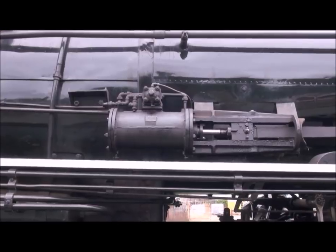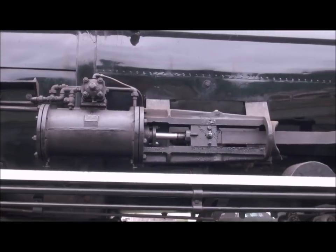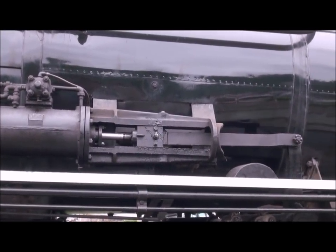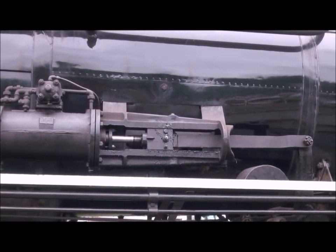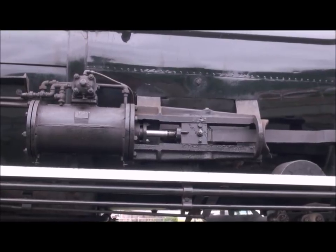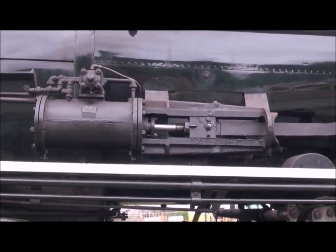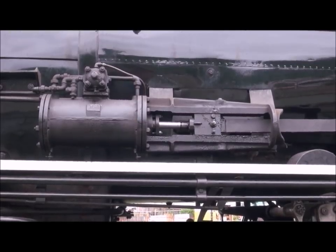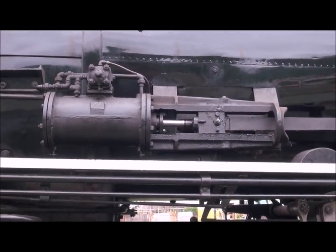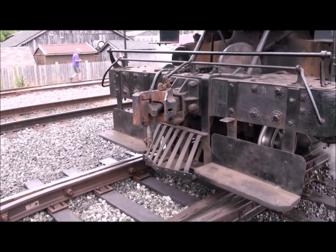Another important aspect is the reverser — the gadget that allows the locomotive to either go forward or reverse. As of about 1932, Congress mandated that all locomotives above a certain weight would be required to have a power reverser, and that's what this is. It makes operating the locomotive a whole lot easier. It had gotten to the point where they were using what were referred to as strong arm or Johnson bars — just a big long bar to operate the valve gear. But these locomotives were getting so big you couldn't do it anymore.